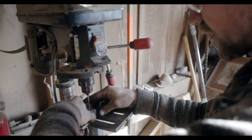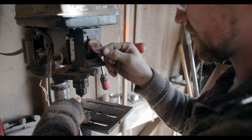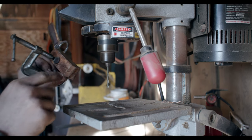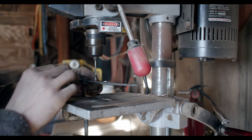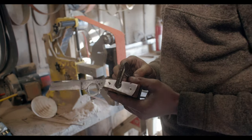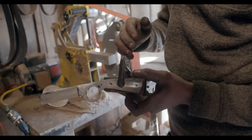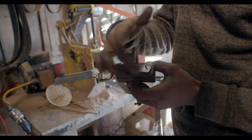I got my handle how I want it, clamped up and ready to drill the pinholes through. I like to drill them like this so the top ridges of the handle line up perfectly. When you're drilling, make sure to hold contact with your drill press table so everything gets squared up and drills through nice and square. Work your drill bit through very slowly — if you're putting a lot of pressure in it you can blow out the wood. Sometimes I'll even put a piece of wood down underneath to help avoid blowout. Once the handle material is drilled, I put pins in there to hold it in place and grind off the excess handle material, which makes post-glue-up finishing a lot easier.